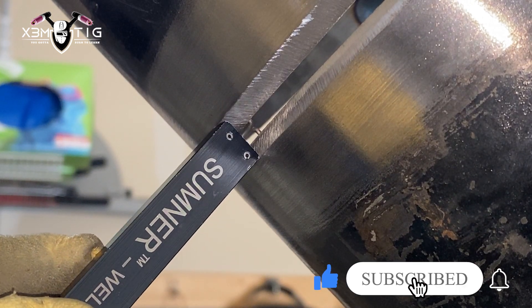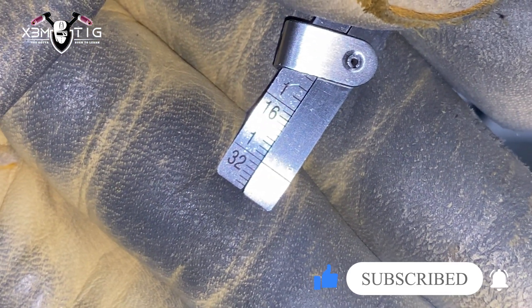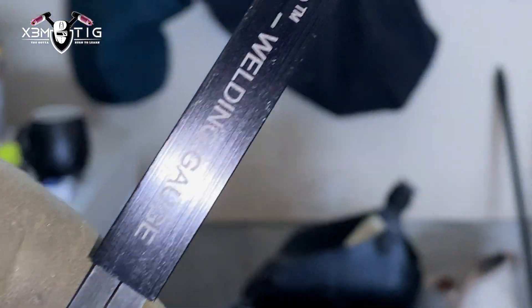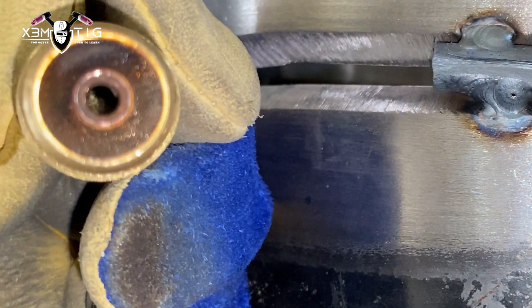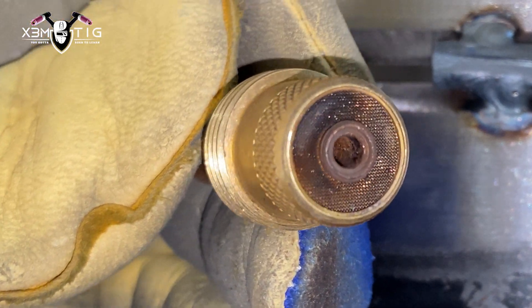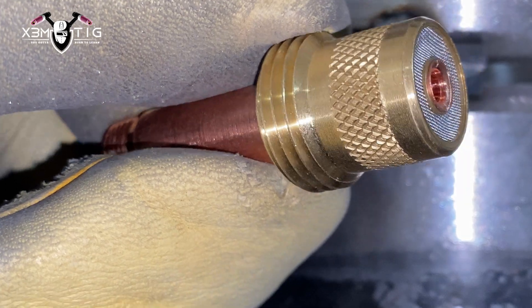For the top section I'm not worried, as gravity will do its thing when you weld — it'll be nice and uniform inside. As I said, the bottom is the most important thing; this is the overhead position and you want everything properly lined up inside. Step number one prior to welding: make sure your gas lens is good, because a gas lens reduces shielding gas turbulence and provides a longer undisturbed flow of gas to the weld puddle.